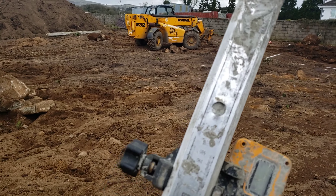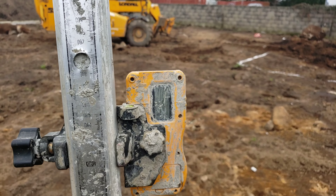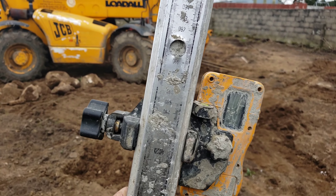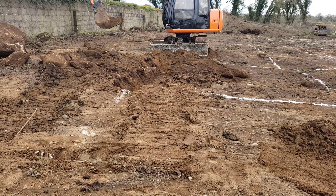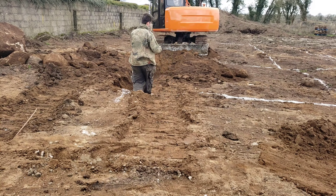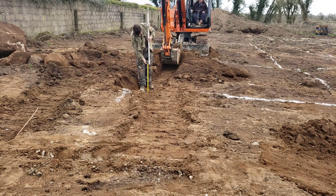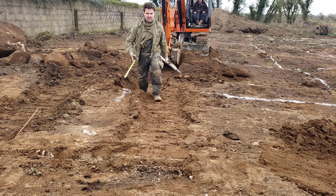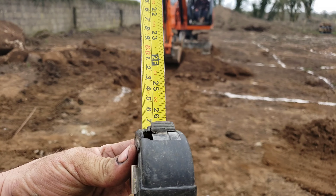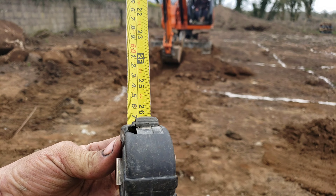You have 225 millimeters of concrete, so from where this hits the laser I need to be a total height of 675 millimeters below this to get to the top — or to the bottom of my foundation. So that's given us 675 millimeters, so that's perfect level for the base of our foundation.